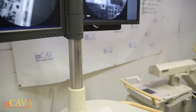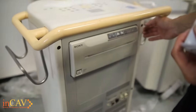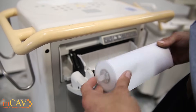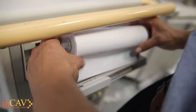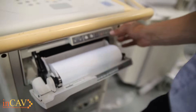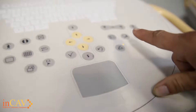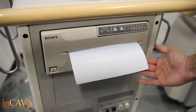Now that we have the image we're looking for, we can do a couple of different things from here. I'm going to go ahead and print one of these images so you can see. First off, make sure that the printer actually has paper in it. I recommend when opening and closing, there's an open and close button here — always use the button rather than doing it manually due to wear and tear, as it can cause problems in the future. This is 210 by 25 high density paper. Go ahead and stick that down in the slot there, roll it over, make sure it's in the slots, then close it. All you have to do is hit the print button here, and as you can see it'll start to print out for you.